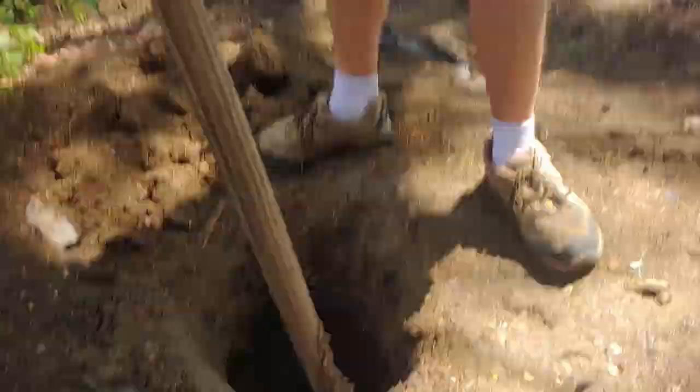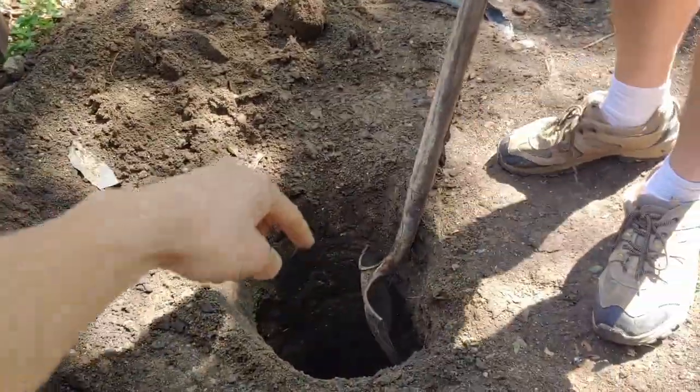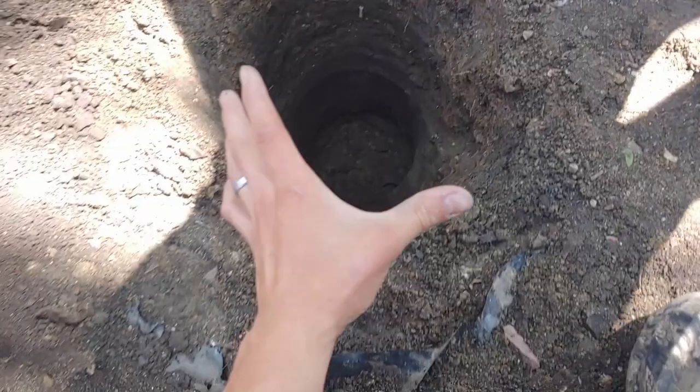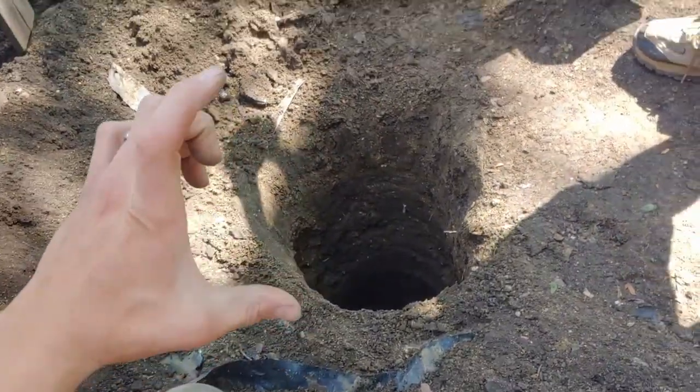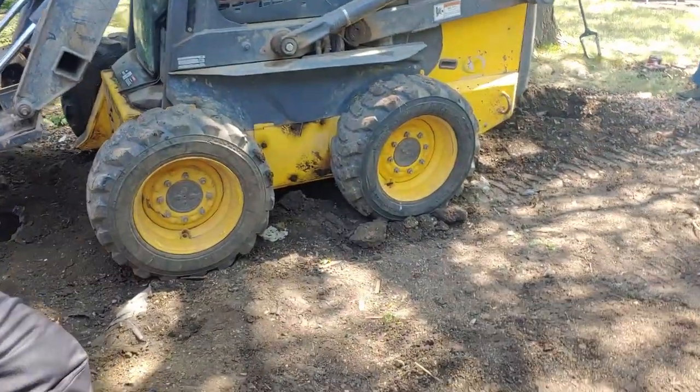They can make it smaller all the way up. We're using a 12-inch bit, so our holes are 12 inches all the way down to 42 inches. Then we're widening out the hole a little bit toward the bottom to get that 14 inches, and we're only doing that for the first three or four inches since it only has to be a three inch pad. Ben is planning to dump sacrete in three inches thick, let it set up, then put treated posts on top and raise those up to the height of the supporting beam to build the deck.